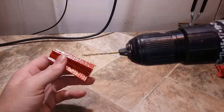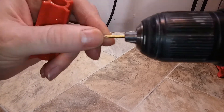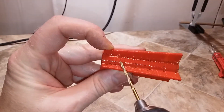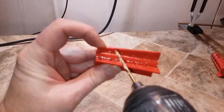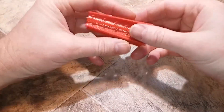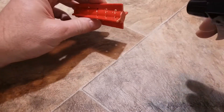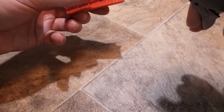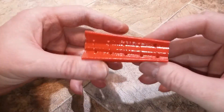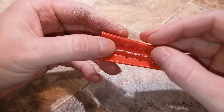With this antenna, you'll have to drill the holes out. This is a 2.6 millimeter drill bit — kind of angle it to go along with the recess in it. This is printed in ABS, so once you have it printed out, you can take a spray bottle full of acetone and just spray it to smooth everything out. You let that dry for 10 or 15 minutes and you have a nice glossy strong finish. This will actually strengthen it because it bonds the layers together — it kind of melts the very outside.